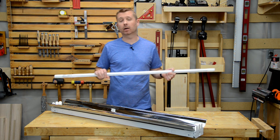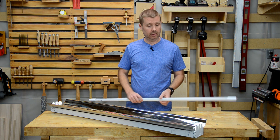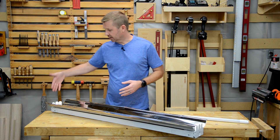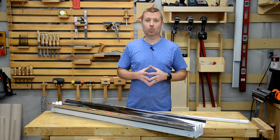Since I'm such a big proponent of bypassing the ballast, I'm going to show you how to do that with this fixture. We're going to bypass the ballast and set it up for a double-ended connection, which is the simplest way to bypass the ballast. This means that connectors on one end will get neutral and connectors on the other end will get hot. If you don't know what that means, don't worry — it will all make sense as I demonstrate this.